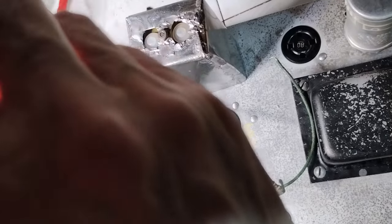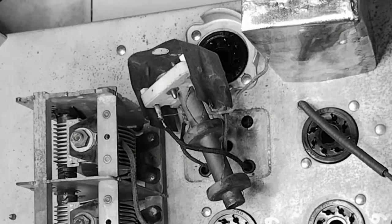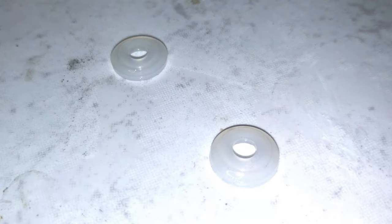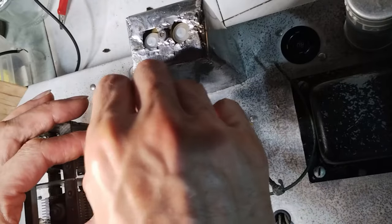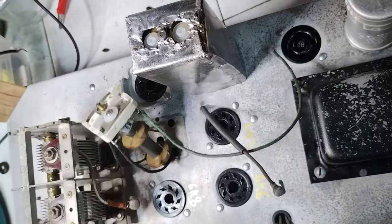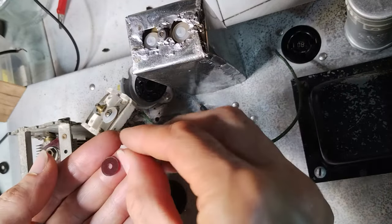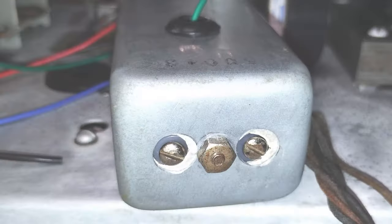However, at this point, the same concern about the insulation of the trimmer capacitors is experienced, due to the fact that the original insulation made of a very thin piece of paper is definitely insufficient. Moreover, in this case, the trimmer screws have a fine UNF thread incompatible with the available nylon screws. Therefore, the original metal screws must be kept. But the holes on the IF shield have been enlarged to avoid the risk of shorting the screws to ground.